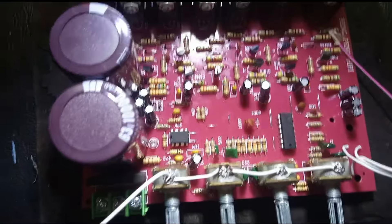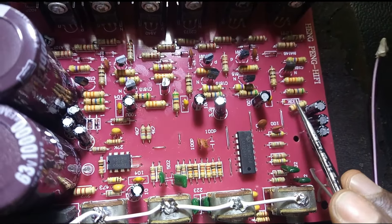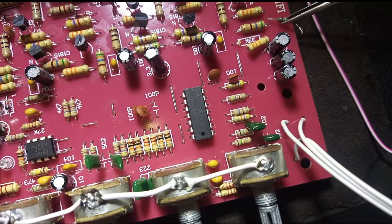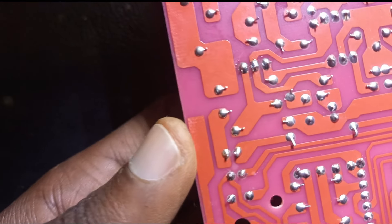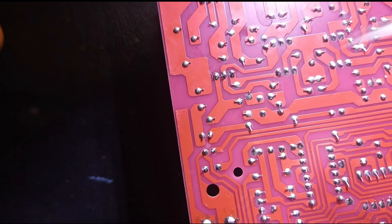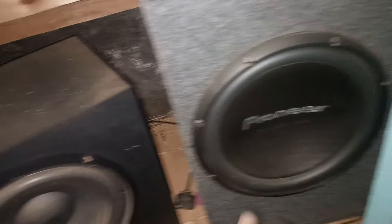This board is having a lot of controversies. Look here — this resistor is just broken, it's a 33k ohm resistor that I realized was broken later and had to change. Also, the other day we realized the transistors were interchanged. On top of that, this board has no relay, so I don't want to risk damaging a subwoofer due to failed transistors. The broken resistor was a factory defect — it was soldered perfectly but just broke on its own, so I won't use the Champion Series.